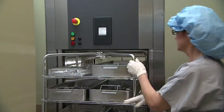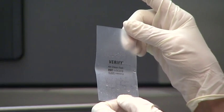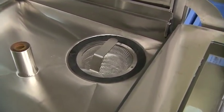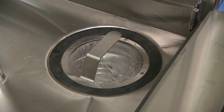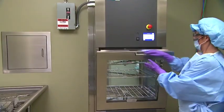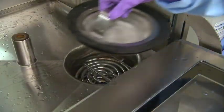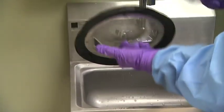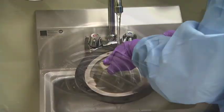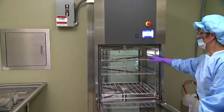Professional standards organizations recognize the importance of monitoring your mechanical and chemical cleaning process. Steris recommends using the Verify All Clean Test Washer indicator on a daily basis. After the last cycle of each day, clean the debris screen located in the bottom of the sump. Allow the washer disinfector to cool down before reaching into the chamber. Carefully open the chamber load door and pull the manifold rack out onto the chamber door. Remove the debris screen and always clean it while it is still wet, before the debris dries. Brush the screen to detach the dirt, then rinse it under running water and reinstall it in the sump. Press firmly into place, roll the rack back inside the chamber, and close the chamber load door.